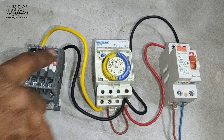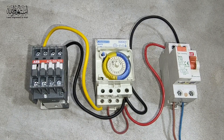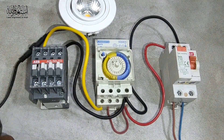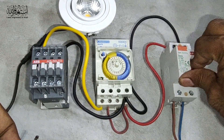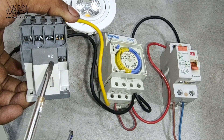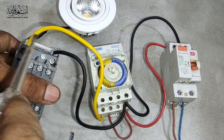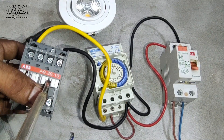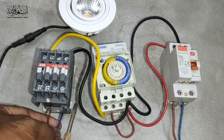So how we connect the load — we can learn that also. This magnet has four points: we give supply here and take supply from the four output pins. For example, I just put the load here — I'm using this light as an example. First of all, I turn off the main supply. Then I take the neutral — we can take it here at A2, same A2 — and you can joint there, there is no issue.